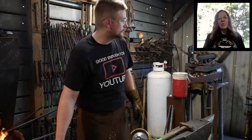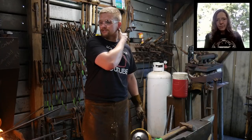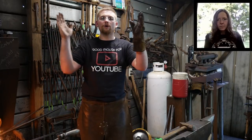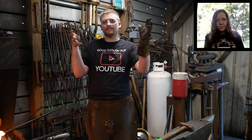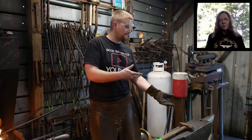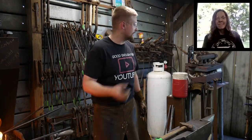The Forge Blacksmithing said, Roy, is there a way to scale the hardy hammer down for use on a 112-pound NC cavalry anvil? Yes, there is. Basically, you just have to shorten the base. The base I made, I wanted it to be deeper. You can shorten the whole shafting and everything like that. You can compact it even more. You may have to figure out something besides the motor that's in the plans or on the print. You'll have to figure out how you want to do that. Yes, it's entirely possible, though. The weight of the hammer should be fine for the weight of the anvil. All that should still be good. You just have to shrink everything in this dimension, not in this dimension. Hopefully that makes sense.